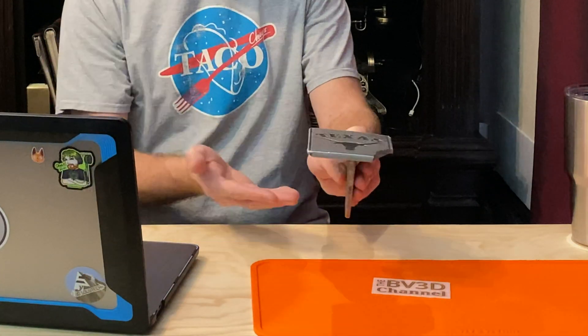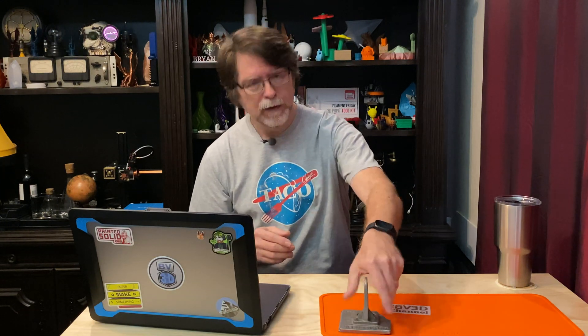A friend of mine needs a replacement trailer hitch cover for his truck. He had one that looks like it's made out of cast aluminum, but he backed into something and broke the corner off. I'm working on designing and printing a replacement for this, but if I wanted to do a layer swap color change to get the University of Texas logo in a different color, I'd have to print it with the logo facing up, and that would use a ton of support material. But being able to print this face down with the logo and the background in different colors on the same layer will really speed up the printing process and make for a better looking final product.